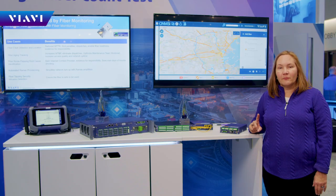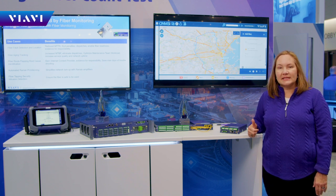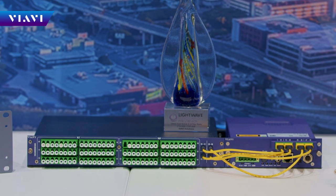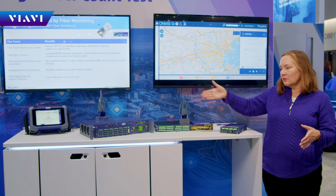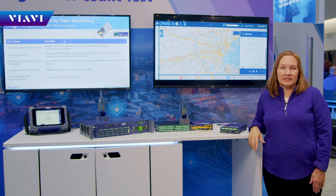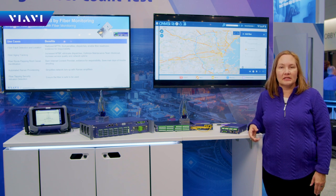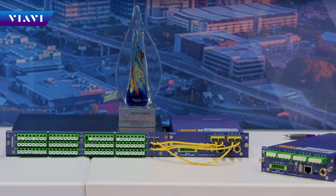When you think about the number of port configurations you need to cover, if you need a high-frequency scan, you want a low number of fibers scanned at very high frequency. Whereas if you are testing a network for construction and you have a high fiber count cable, you might want to use one of these units and be testing 2,000 to 4,000 fibers at a time. That allows you to schedule your testing, walk away, continue your construction process, do your testing overnight, come back, and identify exactly which splices or connectors were not produced correctly so you can repair them before acceptance.